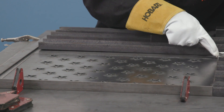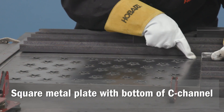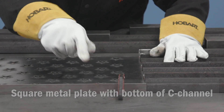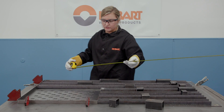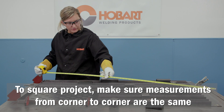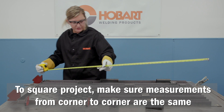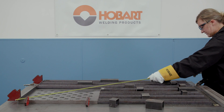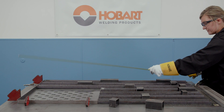Down here at the bottom is where you want to square this up. You want to make this flush right here to the last short C-channel so that you can have this piece of flat stock here to help connect the whole thing to make it a nice square. If you're not sure everything looks square, just go across both corners and make sure you have the same measurement from here to here and from here to here, and then you know you're squared.